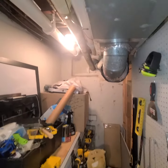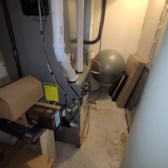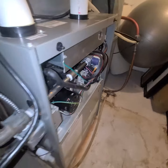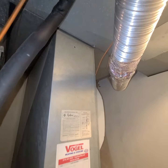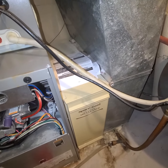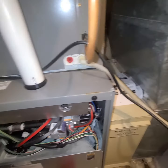We can fix the PVC and reuse most of it, just fix what's going out for the venting issue. For the furnace, we'll come back with an S9X or S9V2. We'll do a 60,000 BTU if they don't add the additional return — they only have enough return air for the 60,000 — and then just cut in a new 5-inch filter.